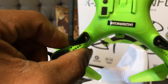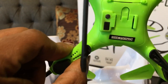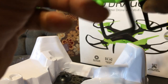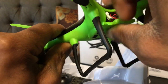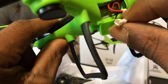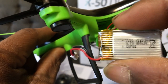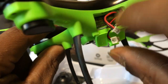It looks like there's a spot if you want to put an additional camera on there — looks like you can slide another camera in. There's an on/off switch underneath. The battery door is in the back, and there's a teeny tiny battery — I think that's a PH 2.0 connector. It's a 3.7V 300 milliamp-hour battery. Wasn't expecting that with this little dude.